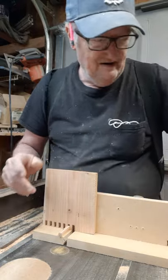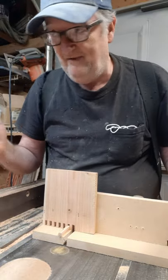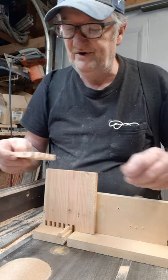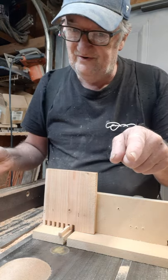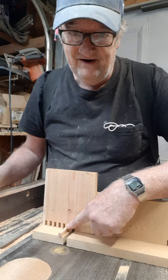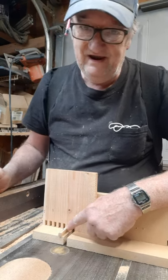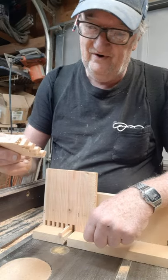Here's tip number one. Whatever setup you do — everybody makes a finger joint jig on YouTube, so we're not going to do that. But there's one thing you need to know about a finger joint jig: it's a little pin right here. Whenever you do this pin, make absolutely sure the height of this pin is shorter than the groove you're going to cut.